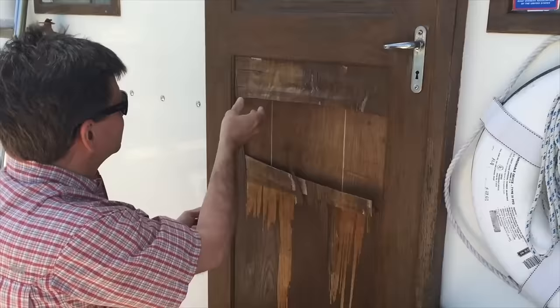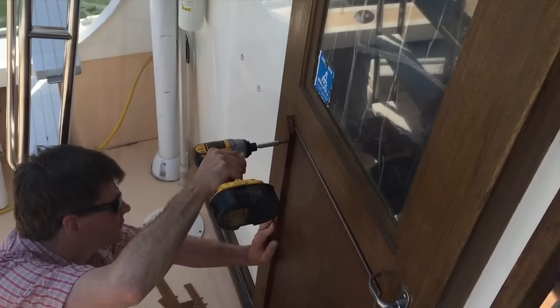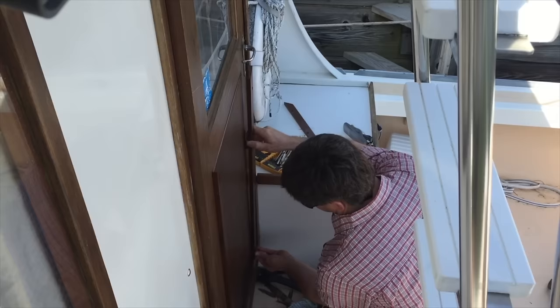It's actually really nice that this one layer of miter is coming off so easily. What are you doing there, John? I'm lining up these miters. I put a scribe line on the plywood — the molding was cut to size in the shop because I didn't want to bring the saw on the boat. So I'm lining up the inside of the miter at that scribe line, and so far everything's working out great.